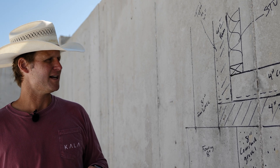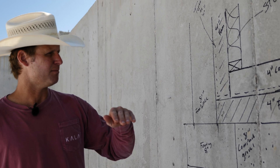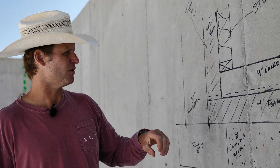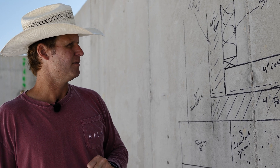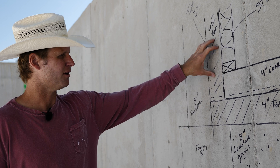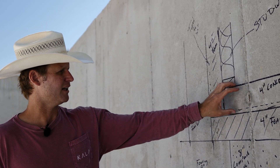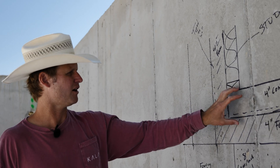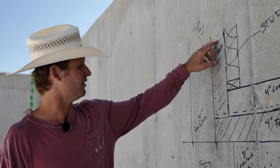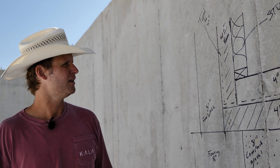The trick with the sequencing is to have our concrete follow this foam and air barrier soon after. The 15 mil plastic will shrink with the sun hitting it, so we want to minimize what might pull away or round out the corners. We'll make sure we're out here the day before to get the plastic and the foam onto the wall, then pour our concrete floor. None of the concrete will be touching any other concrete or anything connected to the earth — it will all be isolated with foam to keep that concrete nice and warm in the wintertime.